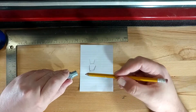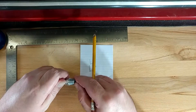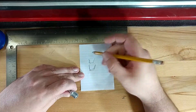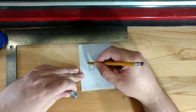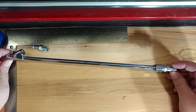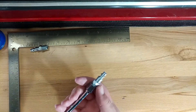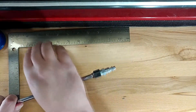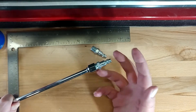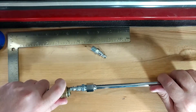You basically just jam them together to seal them. But the problem is even though they are jammed together, we still have a spiral leak path around the outside of these things just because they have threads. No matter what you do, the threads cut on these things are always going to have small leaks in their teeth unless we do something about it. To demonstrate that principle, I've got this super long air chuck assembled with no thread sealer between the fitting and the chuck — just put together raw and gotten it as tight as you likely should. I'll plug it into some compressed air and you will be able to hear it leak.